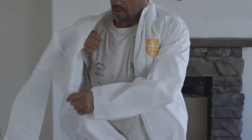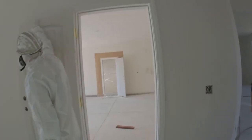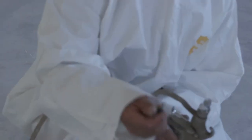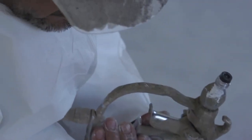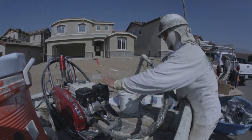Now that we have all of our tools and protective gear on, let's get started. First, make sure that the surface you are going to spray and all surrounding surfaces are clean and free of debris. Assemble the spray gun by putting the tip filter in first, then add the tip, followed by the tip cap and guard. Before you begin painting, do a test pattern on the floor to ensure a full, consistent fan. If you see lines, increase the pressure. Adequate pressure is important — it cannot be too high or too low.